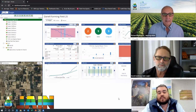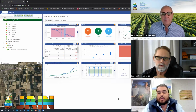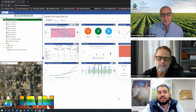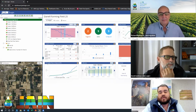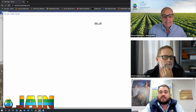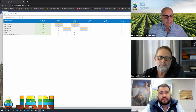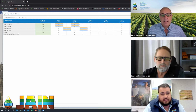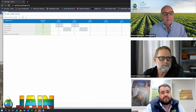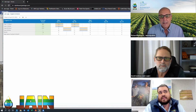Yeah, so actually, this is a great start because this is where I start my day. When I write recommendations, we usually do it on Friday for the week out. I take a look at this first. That way I can see roughly how many hours I need as a baseline. This is the baseline for my ETc, which is ETo and Kc values. So I can look at this and say, okay, how many inches do I need to apply? Luckily for me, Jain Logic does an excellent job displaying the conversion of inches to hours. Here on the forecasted hours, it's saying 48.3 hours for block 1. I take that and see how I want to break this up, before I start doing any math and looking at soil moisture.